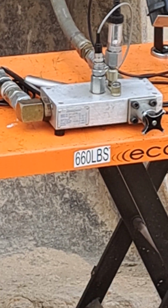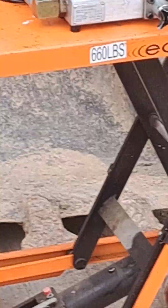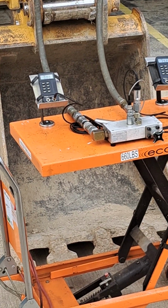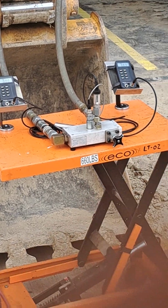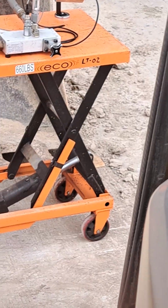If I want to have heel and toe operation for a double acting attachment, like a ditching bucket or a clamshell bucket or a grapple or something that needs direction, oil and flow in both directions, then I need to go look at some other ball valves. One in particular. Let's go.